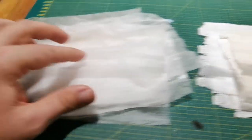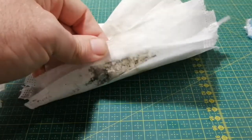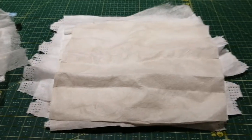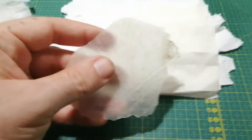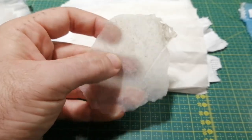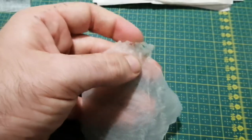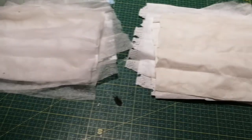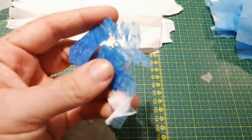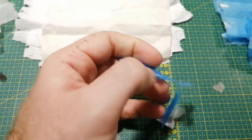So this is a pile of those inner layers. These are those middle filters. As you can see, the middle filters are the ones that really get all the grime and gross stuff. And these are those outer filters that make everyone's lower face nice and blue. The middle filters turn into this kind of clear, cellulose-looking stuff, but it's very brittle. The problem is you can't just melt down all three layers together, because that brittleness infects it. This is a pile where I just took the mass straight up and melted them, and they end up very brittle.